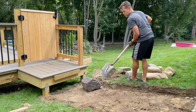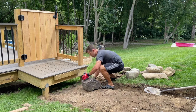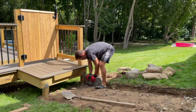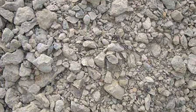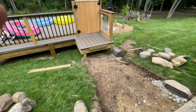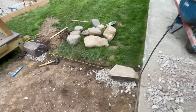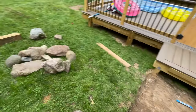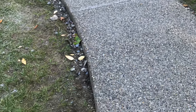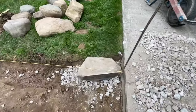Here I'm placing a rock base down for our big rocks. Really, we're building kind of a small retaining wall. As you can see, closer to the deck we have to bring the grade up, so I'm using the big stones closest to the deck. The base that we are using for this walkway is 21AA crushed concrete. 21AA has a variety of different rock — big rock, small rocks, and fine material. Once it's placed and tamped down, it provides a perfect base for pretty much anything — whether it's a full concrete walkway, concrete pavers, or brick pavers. 21AA is the go-to base.